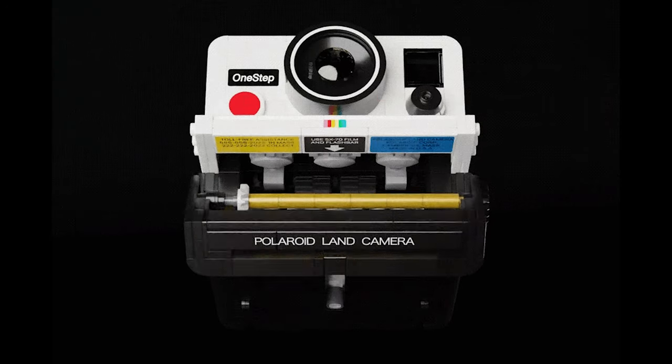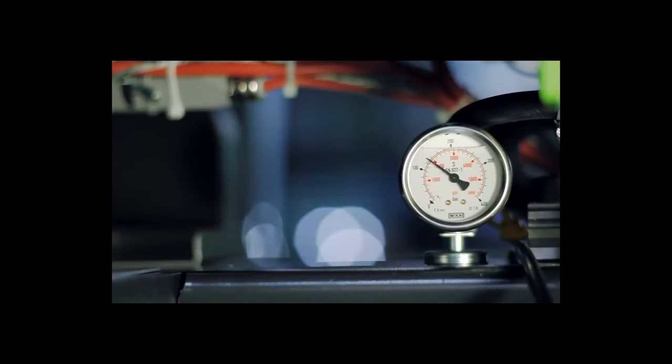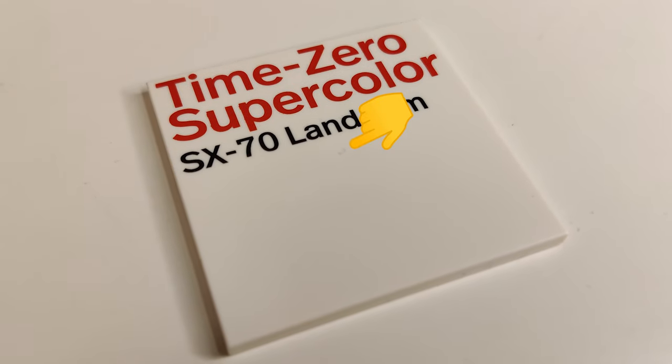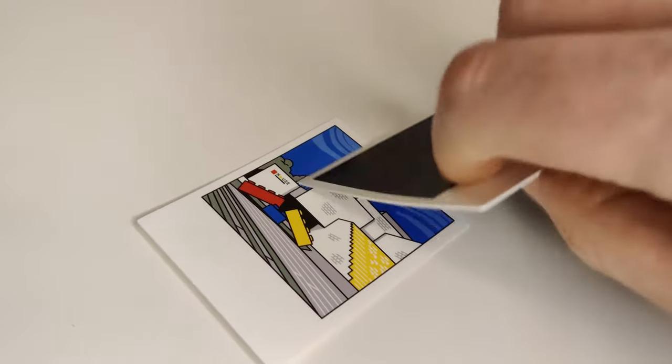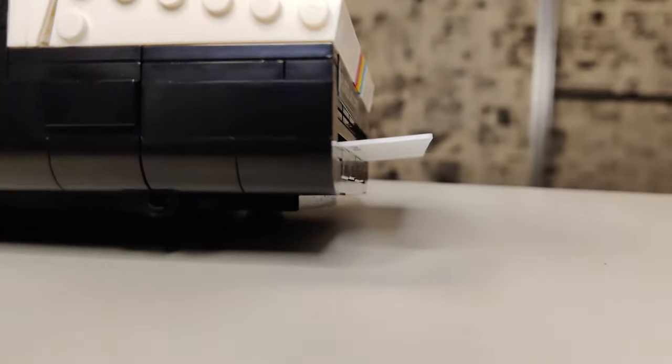Speaking of the pictures, there were originally going to be LEGO tiles like in the fan submission, but we found from the tooling engineers that due to the manufacturing constraints, if we were going to go down that route, we'd have to have a big injection point in the middle. This meant we wouldn't be able to print on that area, leaving a big hole in the picture. So we went with this plastic-y, card-y stuff, which worked much better — we could print on both sides, and it helped with the dampening needed to make sure the photo didn't fly out.